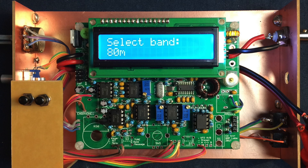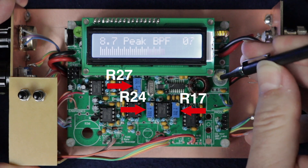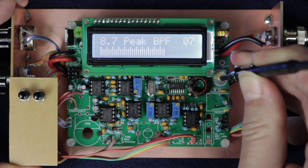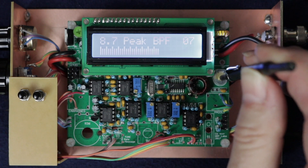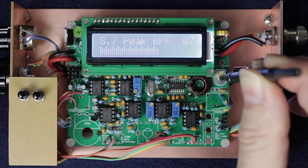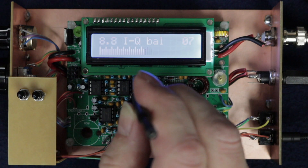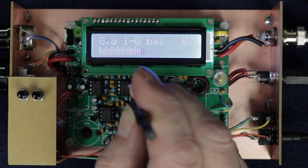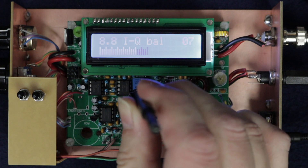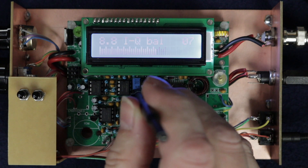First time attaching the battery, it's almost 100% certain the display will either be too dim or too bright. Before you do anything else, adjust R47 so that you can read the display. The manual walks you through adjusting C1 for the bandpass filter and R27, R24 and R17 which fine-tune the IQ balance, low audio phase shift and high audio phase shift respectively. This display works in conjunction with the number displayed in the top right corner — as I adjust, the display initially shows 7 with the bar quite low, grows to almost full scale then drops, and now we're on 8. In this way a small scale can give quite accurate readings. With the bandpass filter peaked using C1, adjust R27, R24 and R17 in turn looking for dips or nulls. The nulls may not seem super obvious at first, but cycling through the process two or three times you start to get more obvious nulls.